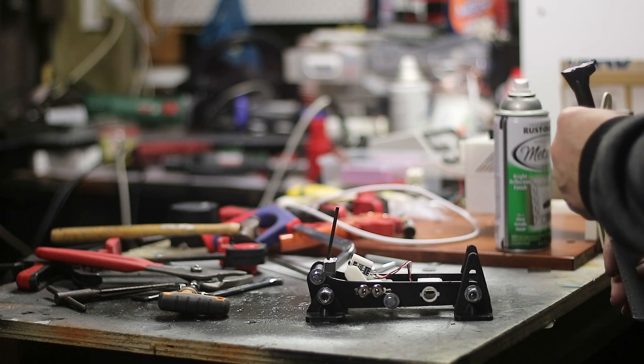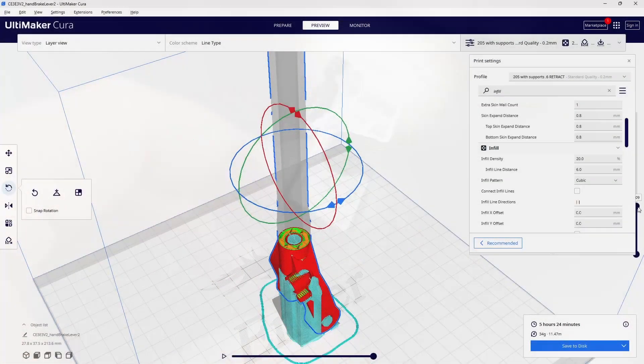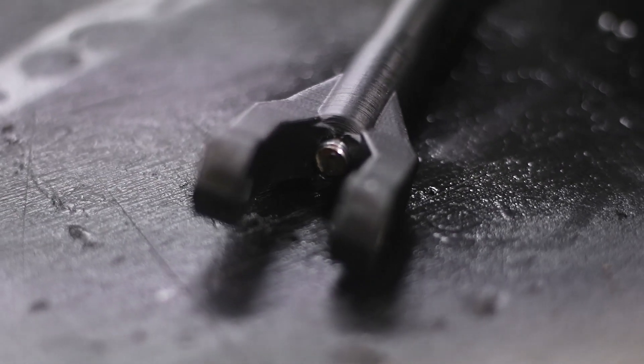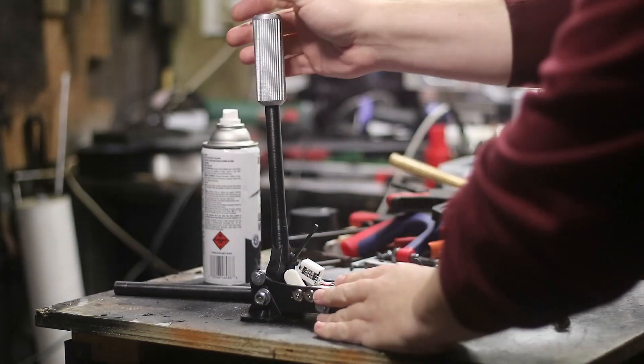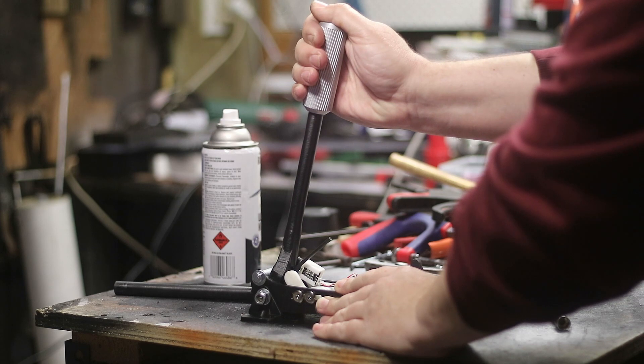There's a good reason for that — if you're not familiar with 3D printing jargon, this is what we call infill. Rather than printing things solid, we just infill them, which saves time and materials but unfortunately makes parts a bit weaker. We can change it to 100% infill, and as you can see it takes twice as long to print and uses a little more filament, but it is indeed a lot stronger. I did that and made sure the thread went right to the bottom, which I hadn't done previously. As you can see, the part is quite strong now — even for PLA it's quite solid.